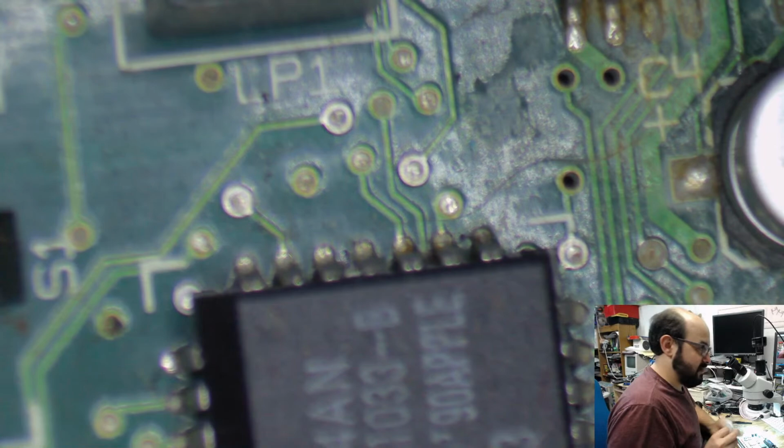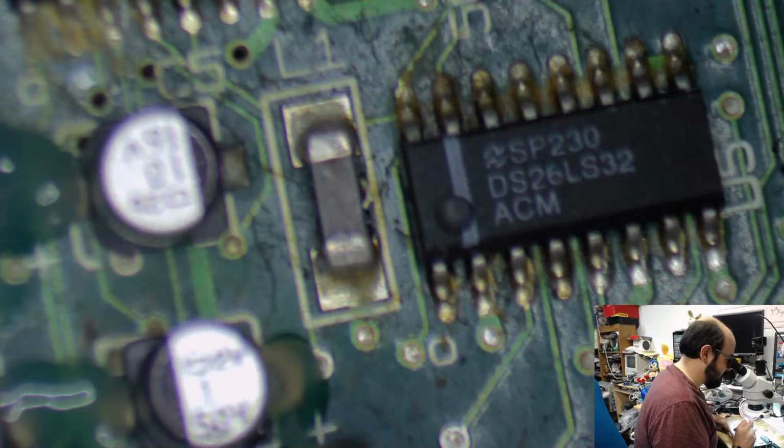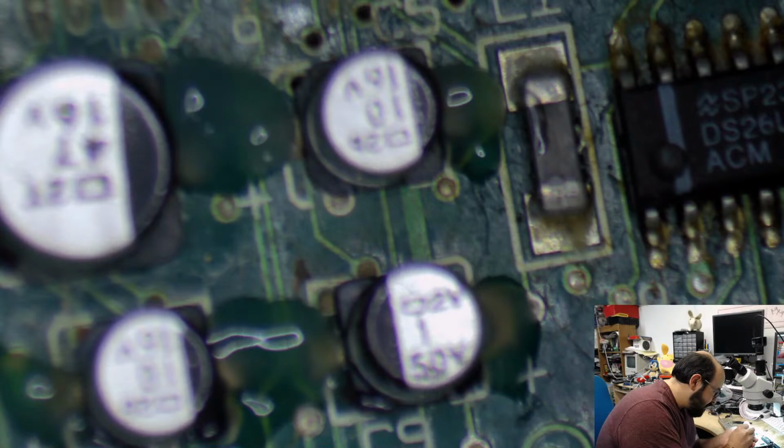Yeah, you know what? Those Radio Shack ones, that's how I learned to solder. And I will tell you, I did not know what I was doing. I really didn't. I didn't use flux. I didn't tin the tip of the iron or anything like that. Night and day once you learn that stuff, because it's like, oh my goodness, I could actually do stuff now, and the solder goes where I want it to go most of the time.